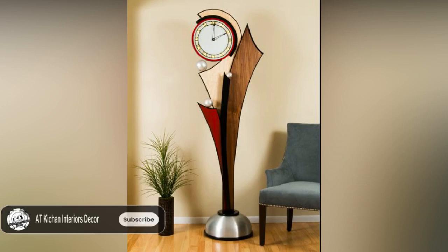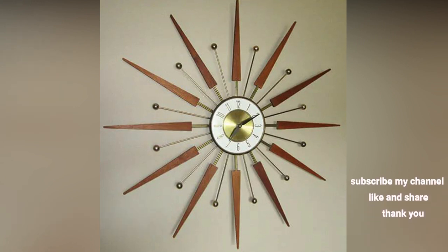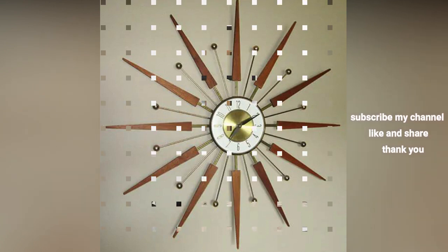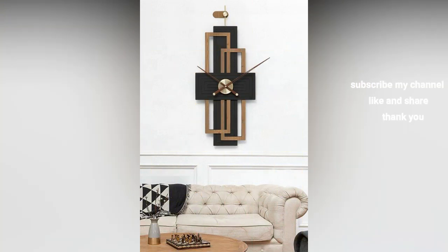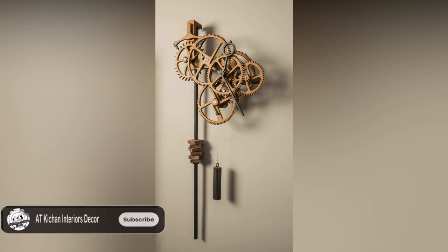To make a wooden wall clock, you will need some basic woodworking tools and materials. Here are the steps to make a simple wooden wall clock. Materials: wooden board, clock mechanism kit, sandpaper, wood glue, stain or paint (optional), drill, jigsaw or circular saw, router (optional), pencil, ruler, clock hands. Steps: begin by cutting a wooden board to your desired size and shape using a jigsaw